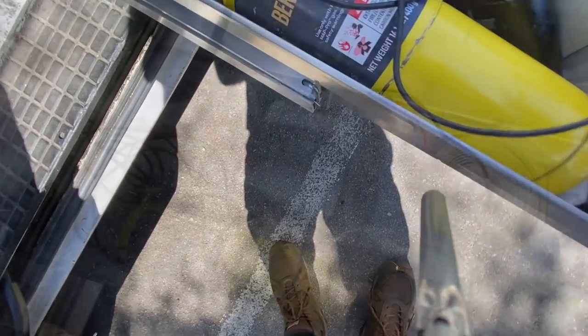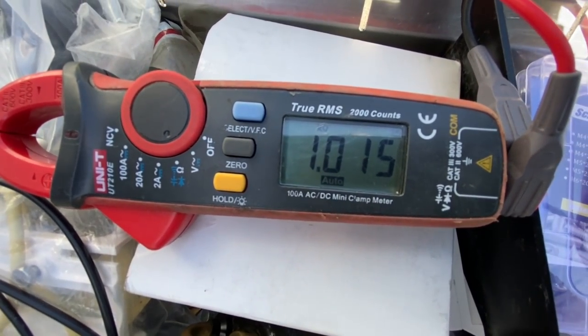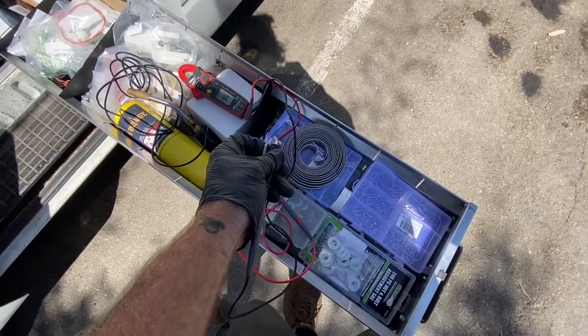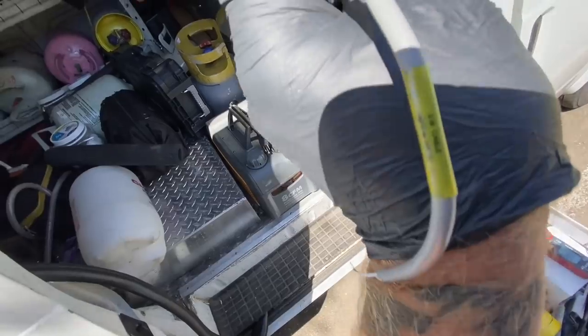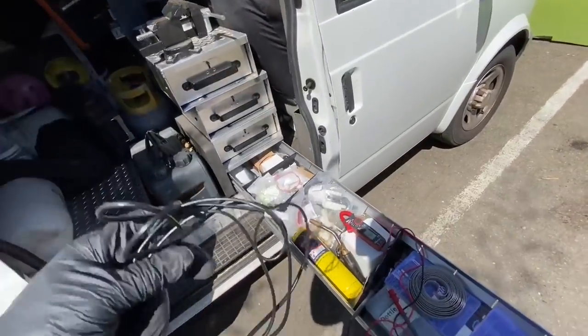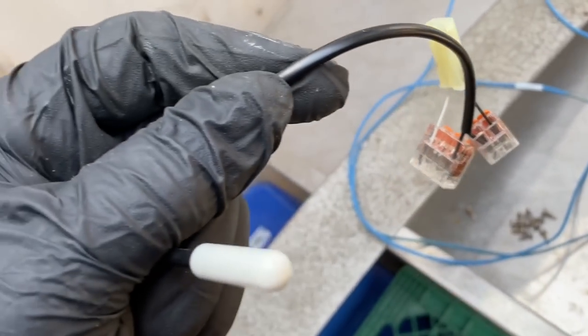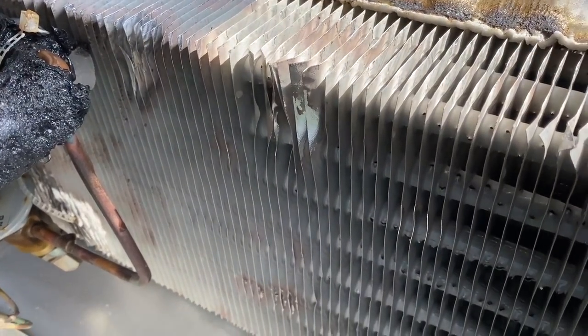It's the other style probe — the Penn Johnson probe hooked up, reading 1.015k ohms. Different probe types, different ohms values. But I looked it up on Charlson's website and this one will work for the evaporator. There's my dead sensor. I just cut the Molex connector off of it and connected it to my new probe. And I just melted all the ice off too, so we got a clean coil to work with.